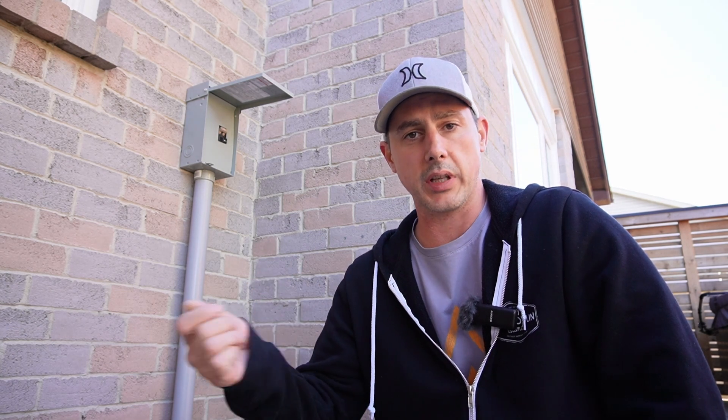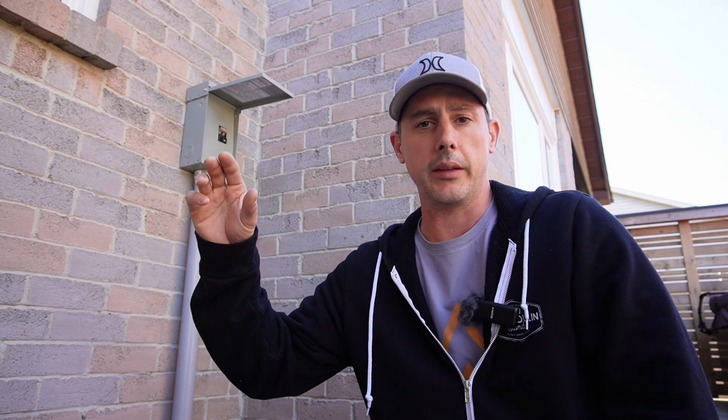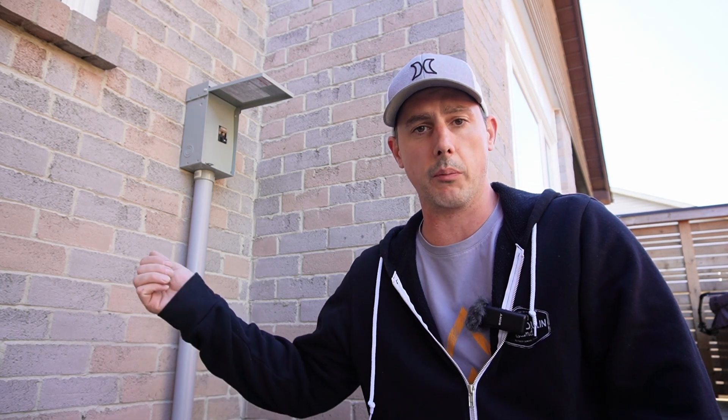There are really two reasons why I'm hooking it up this way. One is so that I don't have to open up my basement window and throw extension cords in the cold and then seal it up temporarily. This way it's easier, looks a lot cleaner, and runs a lot smarter. The second reason is I will never backfeed my house. You can get kits where in your panel it locks you out so you can't turn your utility breaker on at the same time your generator is backfeeding your panel. If you backfeed into a dryer plug, that is illegal — backfeeding 240 volts gets brought up to the transformer lines and the transformer will reverse that voltage through the lines and you can really hurt somebody. I'm just not going to take that chance.